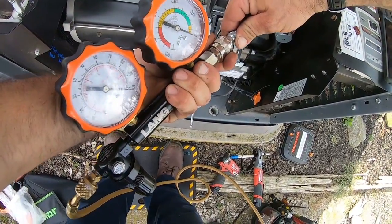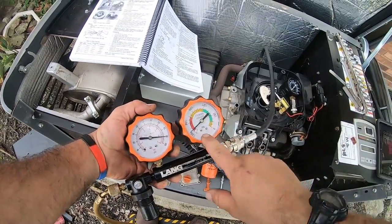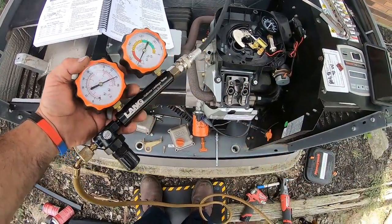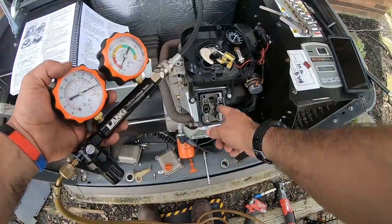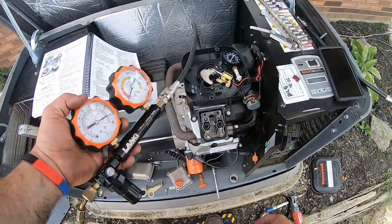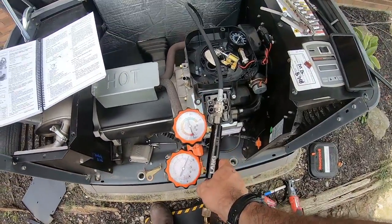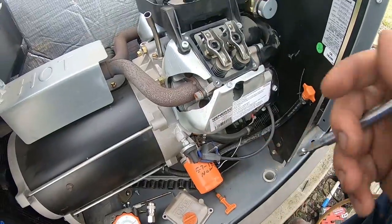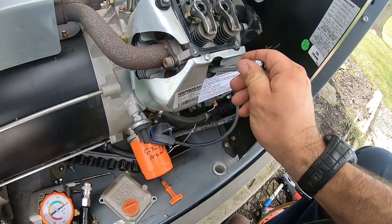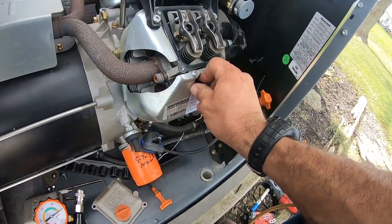We hook up our hose to the cylinder and as you can notice, we are leaking at about 95%. Listening for where the air is coming from — I can hear air down here in the crankcase. I don't really hear anything in the intake and I don't hear anything in the exhaust. Now we'll go ahead and do a test on the front cylinder to show you what it should have looked like, and we're going to get it to top dead center — watching her come up, seeing this one go down.